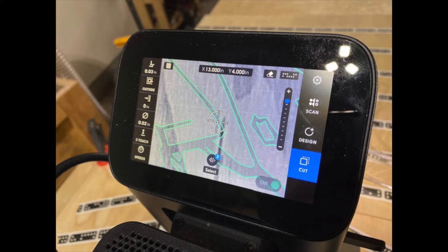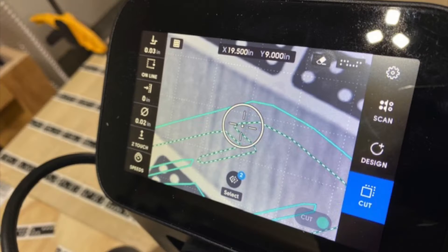All the green lines are the lines we can cut, and we're going to use a 45 degree v-bit at 0.03 inches, which is fairly typical for engraving, to see how that turns out. When you go to a line and you're ready to cut, the line turns into a dashed line — that will be the line you cut.